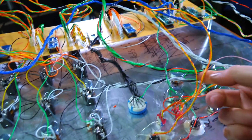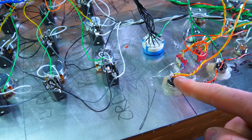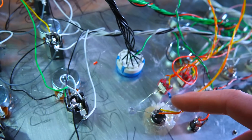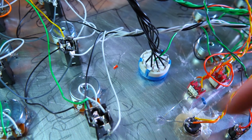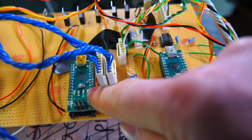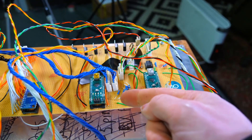Another thing I found: if you've got the MIDI output from the Arduino, you can wire in parallel an LED from the five volts positive leg to the signal wire via a 1k resistor. That gives you a little signal indicator on the front panel of what's going on. Alternatively, you can just look at the TX LED on the Arduino Nano - interestingly, the cheap knockoff Arduinos do show TX activity, whereas the legit ones don't seem to for some reason.